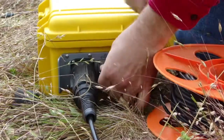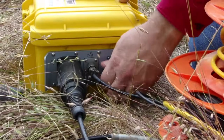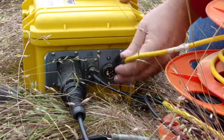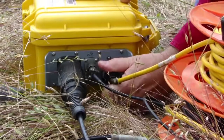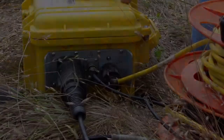As is often the case with such seismographs, a sledgehammer is used as the energy source. The final connection to the geode is a digital cable which connects to a field PC. Above the connector is a small circle with an arrow pointing out of it — the circle represents the geode and the arrow shows that data is flowing out of it and into the PC.